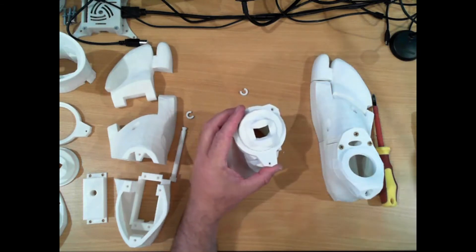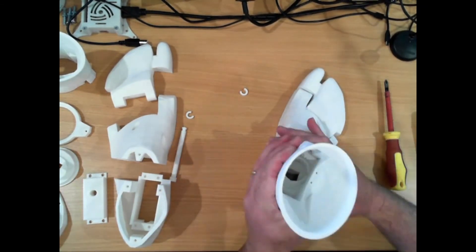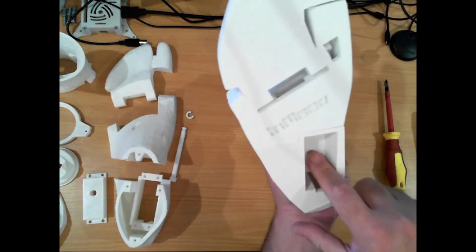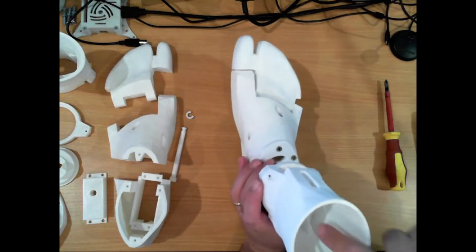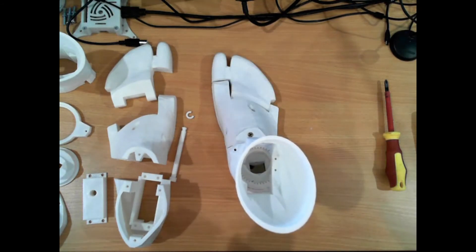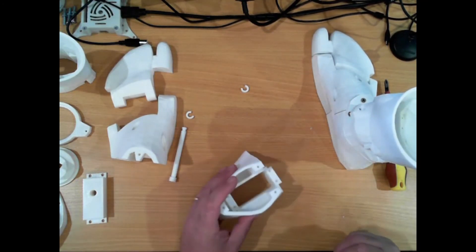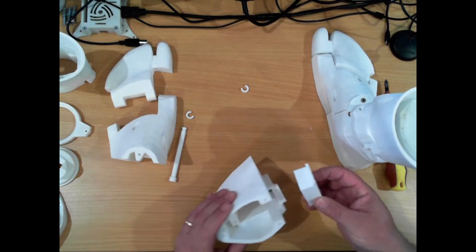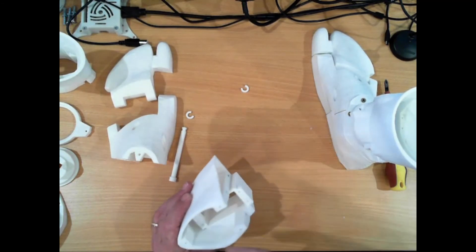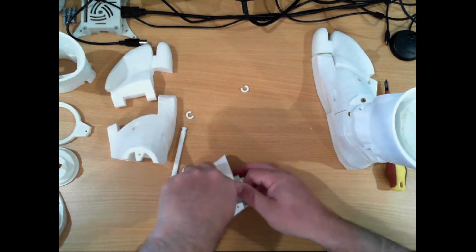At least we can adjust the pose on these. So the idea is, once all the leg is assembled together, a threaded rod will go through this block — nut top and bottom — and it runs up through the middle here and through the remainder of the legs, and is attached to a plate or a brace in the top of the leg. When I get to it, I'll show you that one too in another video. Now this block has the hole offset, and that is actually going to be on the side with the cut-out in this servo holder for where the wires would be — so the hole towards the back of the heel, in other words.